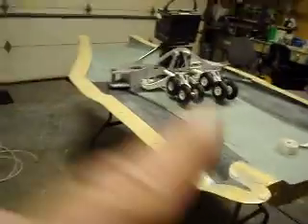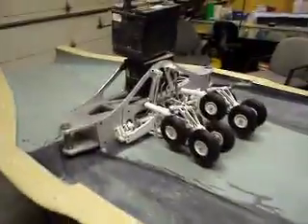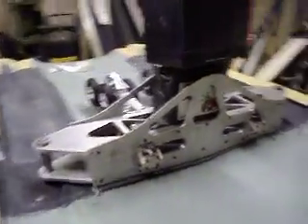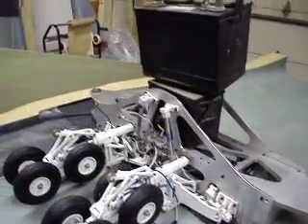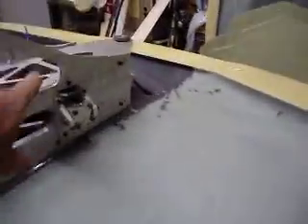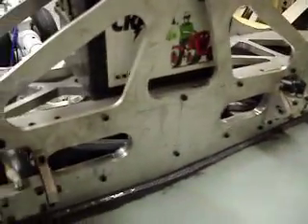Then I put my bottom on — I'll already have that flange glued on there, so I won't have to reach in and do that one. I'll just have to reach in and do the sides. We'll set up the tripod and show you how we do that. It ain't as bad as it sounds — that's the easiest part of this project, gluing these two pieces together. We're going to have it all glued together tomorrow and Wednesday, ready to pop out of the mold. It fits just like a glove — perfect fit. I just need to do a little grinding; there are a couple of little high spots that have to come out, but I've got the Dotco with one of those round files on it and that'll come right down.